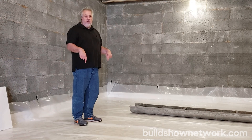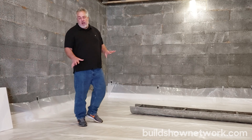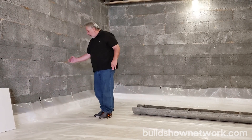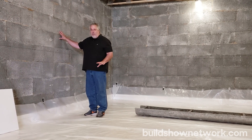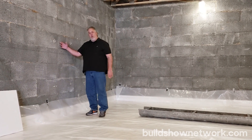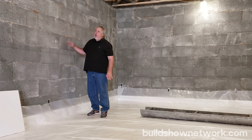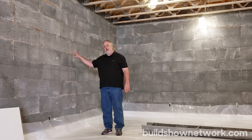Tomorrow there's going to be a totally different look here — all this foam will disappear and we're going to have that concrete slab. We're going to have the poly sticking out of the ground. We'll continue with insulation up the wall, but we're going to switch to a wood-framed wall, pack that with cellulose, and run that all the way up to the bottom of the joist. That gives us that continuity of thermal performance — under the slab, up the sides, and then it connects to our wall.